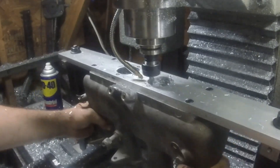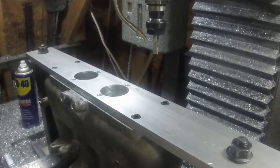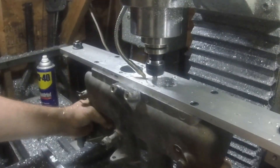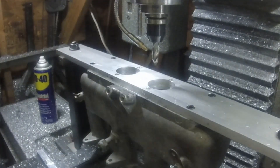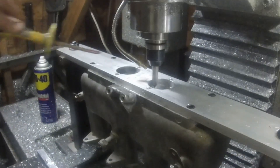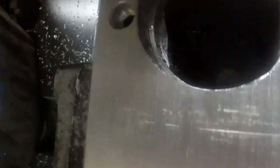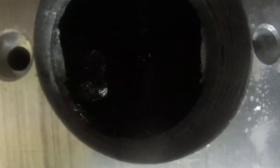So here we're just walking it up to the final diameter. And here you can see there's a little bit of interference — some casting shape in there. So what I did was just took an angle mill just inside the hole, so that it put a bevel on those casting parts. Shouldn't be a problem. He can take a file to it if he wants to, to get rid of those.